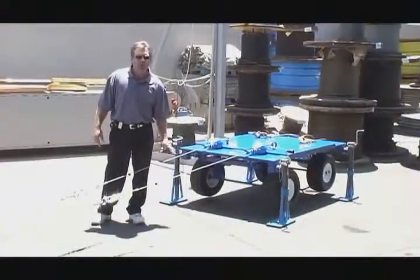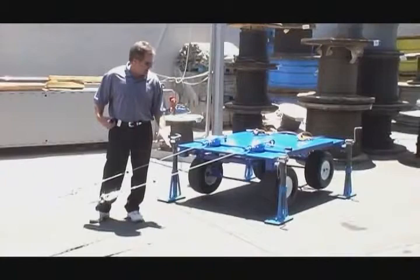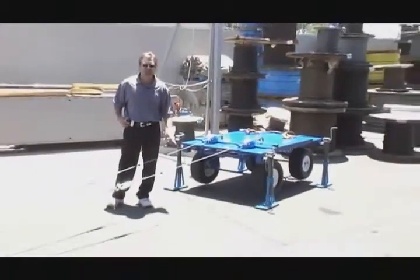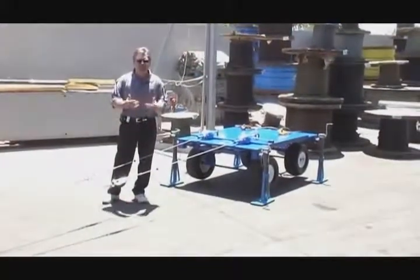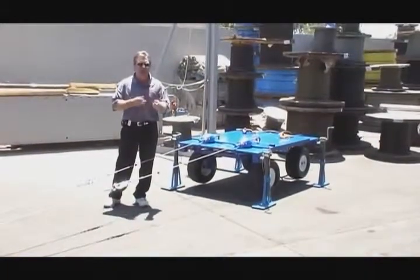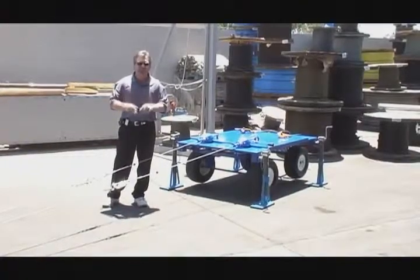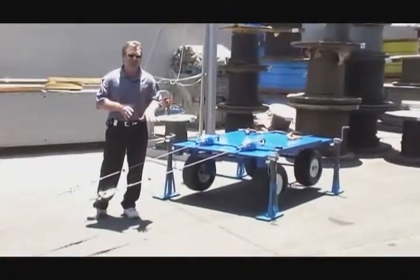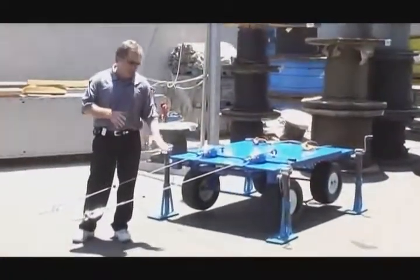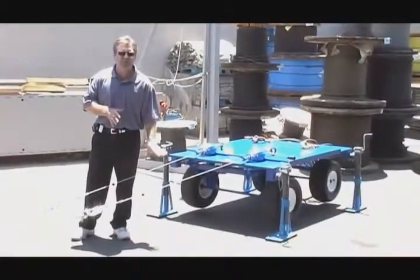The reason we're using a 440-pound rigid test weight is that it's the same as two 310-pound individuals, because the human body has natural shock absorbing capabilities — the organs slosh around, your spinal cord bounces — whereas a rigid test weight is going to make a much more severe hit. That's why the weight is only 220 pounds per side, or 440 pounds total.